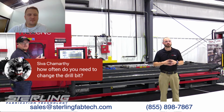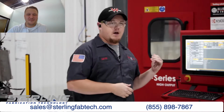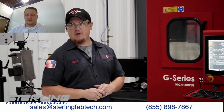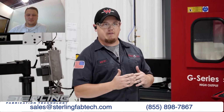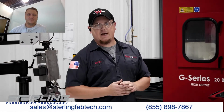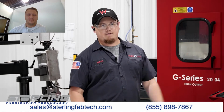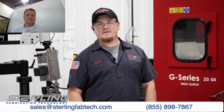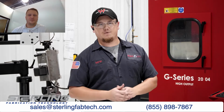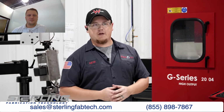So how often do you need to change the drill? Aaron, would you be able to answer that question? Yeah, so a lot of it depends on the kind of drill that you're using. I mentioned that we're using the OSG Mega Muscle drill here. It's a very high-powered, 3-fluted drill, and they have actually changed the design of the drill. They added a different coating and changed the geometry a little bit. So instead of being a Mega Muscle drill, it's actually an ADO TRS drill. But if you're using a high-performance drill like that, I know we run some carbide tops here in-house where we are drilling 200-plus holes on a plate, and we ran over 2,000 holes with one drill, and the drill still looked good. Wow. So it's all dependent on what kind of drill you're running and what that drill is meant to do.